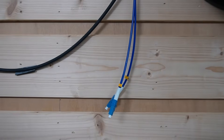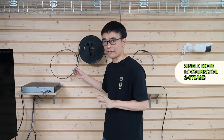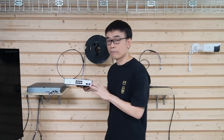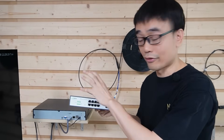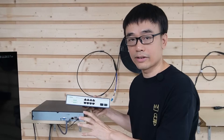This is the pre-made fiber optic cable. The connector is built in the factory with a pulling eye, so we can pull this cable through the conduit directly. It is single-mode LC type, and we have two strands in this single fiber optic cable. Now we are going to add our first device — an 8-port PoE switch. There are a total of eight PoE ports. We can connect the cameras in the control room to these PoE ports, and also the network video recorder and the computer.